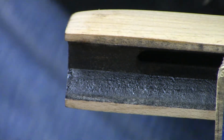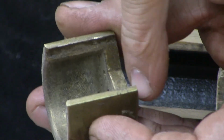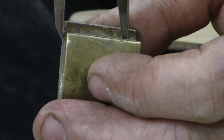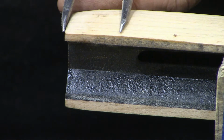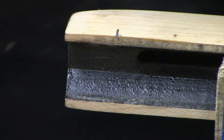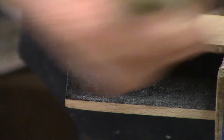Okay, so the next thing we're going to do is put this nose cap in. We'll take this measurement. You can see this. Can't go all the way because here's where the wood butts up. So we're just going to measure from that to the end. So you get that mark, and I'm going to have to go in. First I'll take it all the way around, and I'm going to come in with a chisel and just work that end off until the nose cap slides in.